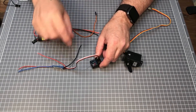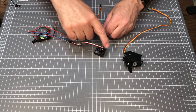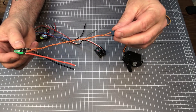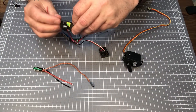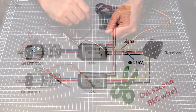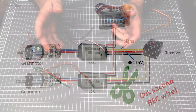If you look at these two ESCs, this one has a BEC to power a connected receiver, whereas this ESC only has a signal and ground wire, and the receiver would need to be powered externally. It should be remembered that regardless of where the power is coming from — whether it's a BEC, the BEC of an ESC, or some other regulated source — only one power source is used. For more on this, please have a look at the MCR ESCs video.